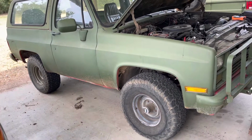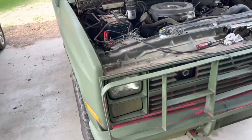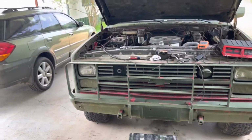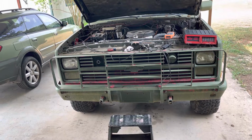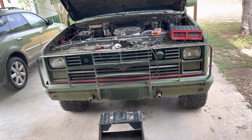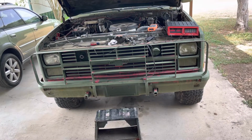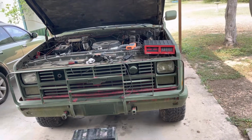6.2, 6.5 diesel engine, mechanical DB2 injection pump timing. I've already done a video on the different methods, such as using a screwdriver to check your timing but not knowing what number it is. Talking about the timing light method with the adapter, the pulse adapter, and the Snap-on Lumimag 1 and 2.